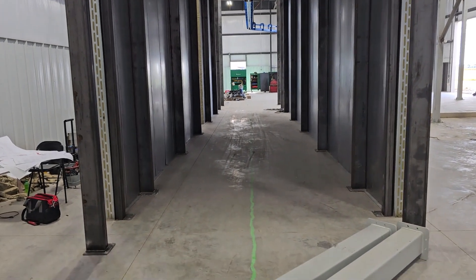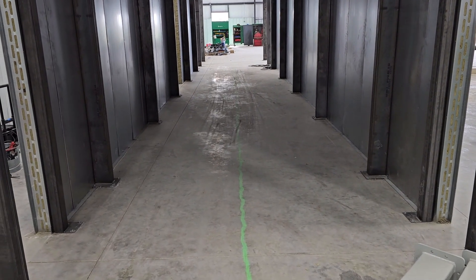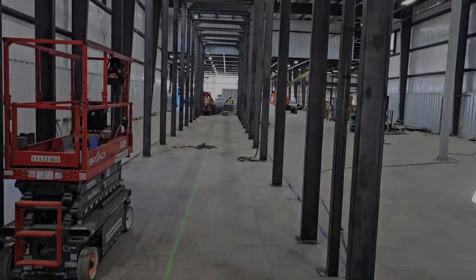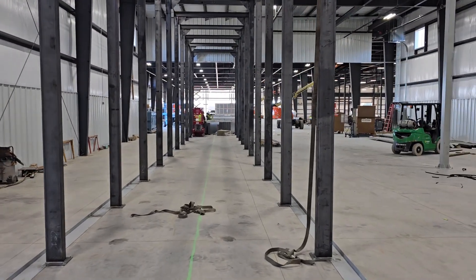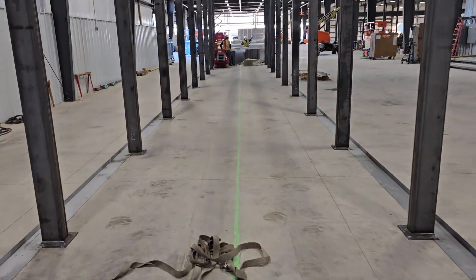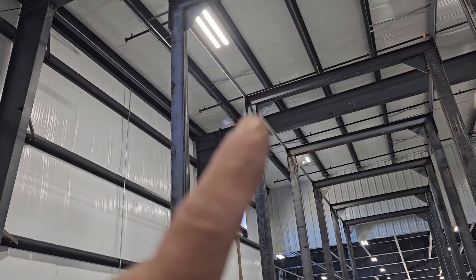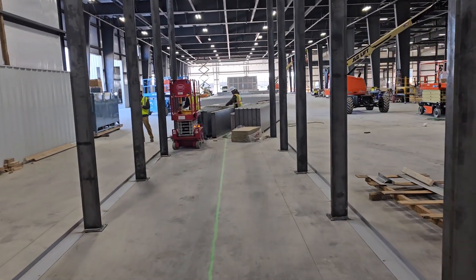Only after that high reach work can we put a floor in. There was a comment on the channel about the floor — how do we protect it? Well, we insulate it two inches and put a B-deck, a corrugated B-deck, down on the floor. We've put all our upper angles on and released our straps. We put diagonal straps on to impose our will on the squareness of the entire structure, so now we have a nice square structure with that little triangle keeping everything plumb. Now we're ready to skin it.